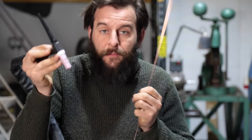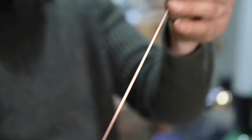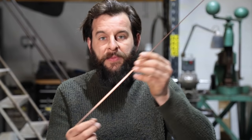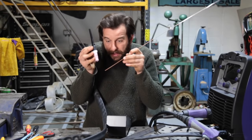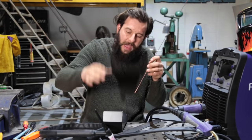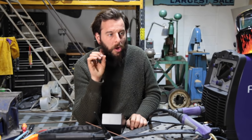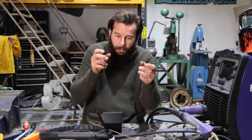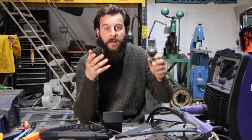Your right hand is holding the torch and melting the metal. The beauty of TIG is you have filler rods that you buy separately. These are available in all sorts of different materials - different blends for steel, stainless steel, aluminium, brass. Depending on what you're welding you just get a different filler rod, and you can add filler rod as you desire. You might add a little bit, then it's a bit too much, so you can slow down and get a nice rhythm going. It's a bit more complicated because you're using both hands and one foot, but in the long run TIG welding is a lot more versatile and adaptable. If you're laying upside down underneath a car, it's more difficult to TIG weld - that's when you might prefer MIG.